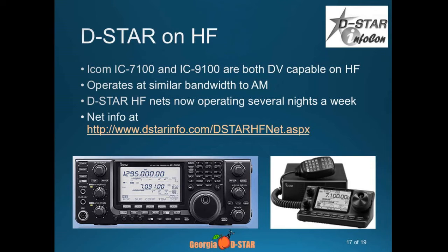What's nice about these radios — and to a certain extent the 5100 as well — is the USB interface to the radio; it's almost plug and play. If you're running Ham Radio Deluxe, especially in digital modes, our club operated Winter Field Day for the first time and I was the digital station with my 7100, running with a laptop, running PSK, with just one USB connection. That was nice.